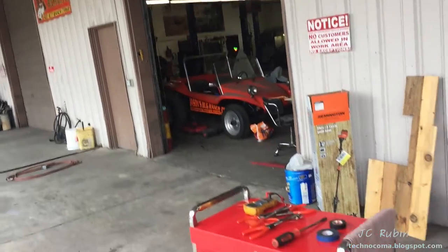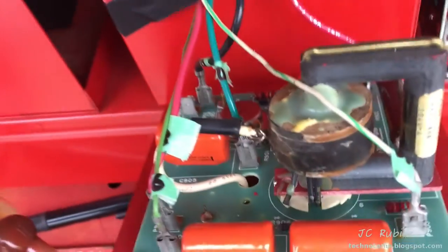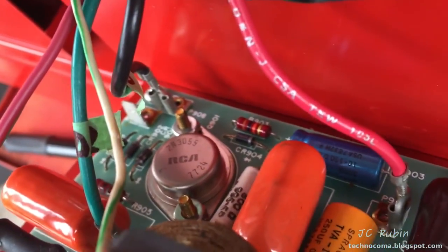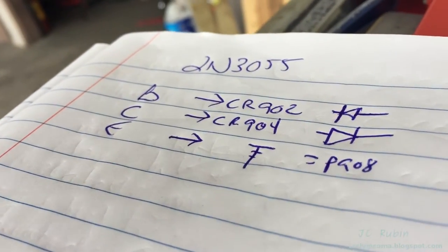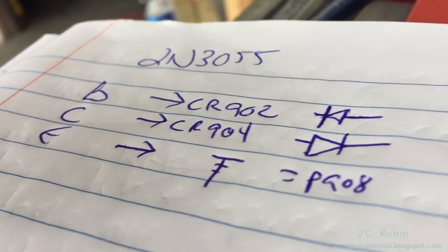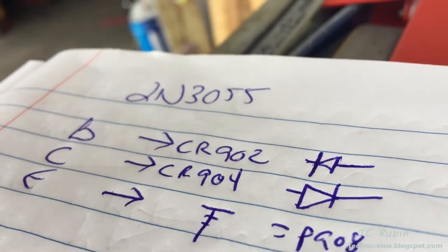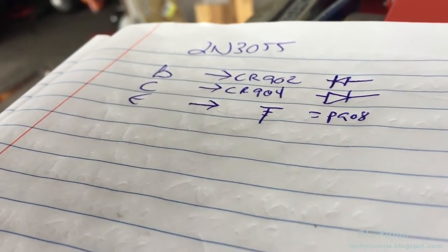Jason prepared some lunch over there. Took apart the circuit board just to see where the connections are on this transistor. I know the transistor's getting power and doing something, so I just needed a safe way to know where I could measure the base, collector, and emitter. I had a good feeling about the base already but just wanted to recheck. These are the test points: the emitter is ground, but the official ground test point on this is P908 and P907. The base and collector are here, and I'm going to retest these and annotate what the voltages are in full operation.